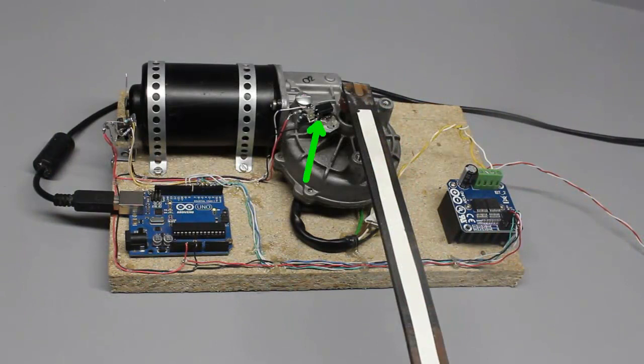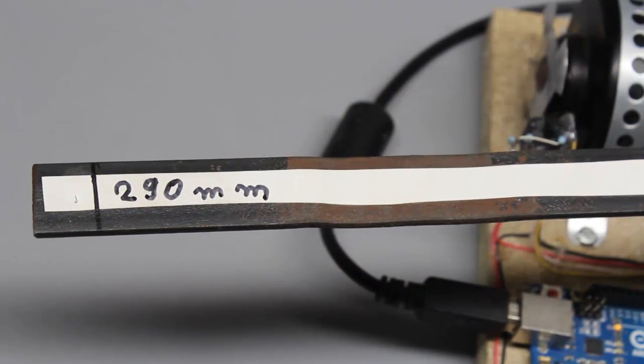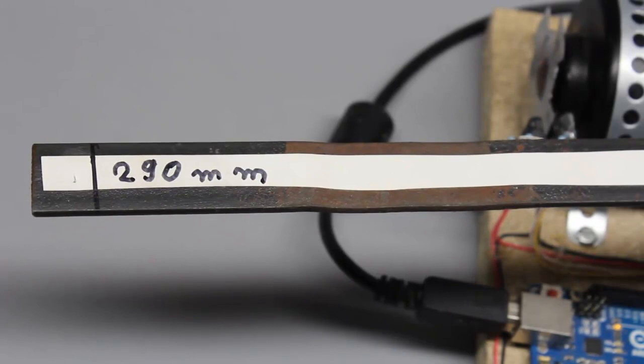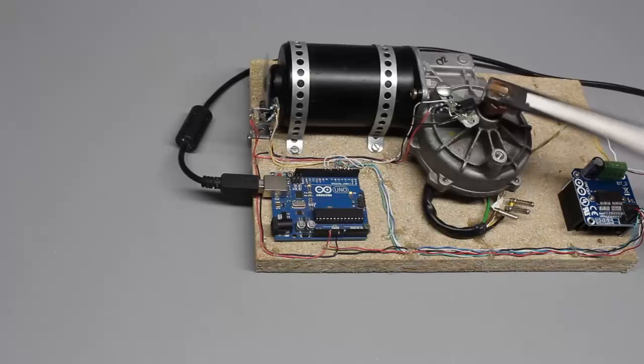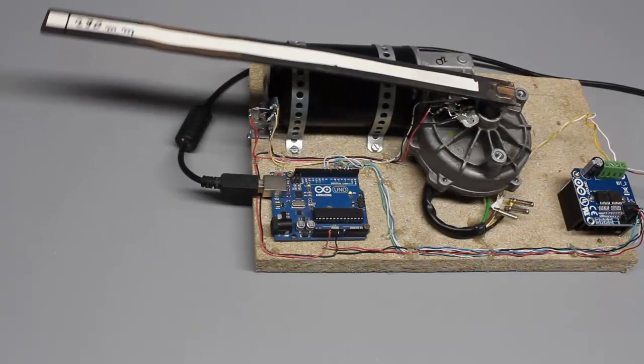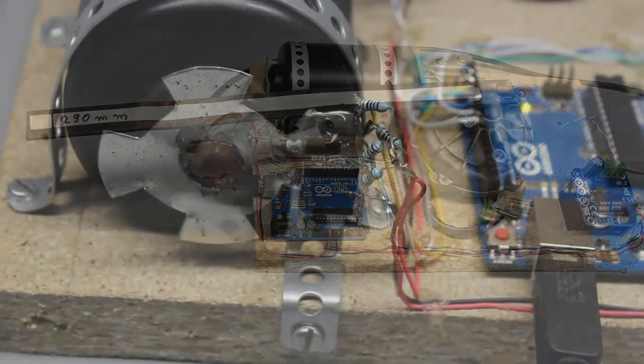When turning on the Arduino, the lever of that home-built servo rotates until a third photosensor transmits a high signal to the microcontroller. The worm gear has a transmission of 120 to 1, giving approximately 0.2 degrees per step in theory. Note that clearance reduces that theoretical precision. You get a very powerful and precise digital servo. To get the maximum speed and torque, some software parameters of the control loop in the source code of the Arduino have to be adapted. Besides the proportional controller, a soft-start function is implemented to avoid current peaks whenever the servo starts spinning.